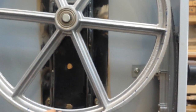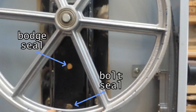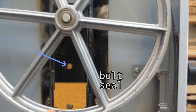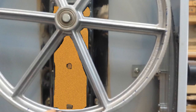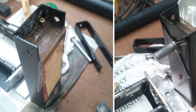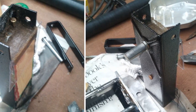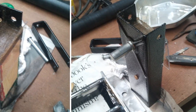This whole vibratey area got the sound deadening sand treatment, which basically involved plugging an existing hole with a bit of old cork, sealing up the bottom and back of the C-section channel, putting a bolt in the bottom as a drain plug, and then filling it from the top with a funnel. Later when the bandsaw moved shops it was useful to drain the sand out, and after that I replaced it with epoxy granite, which has even better damping properties and creates a really rigid structure.